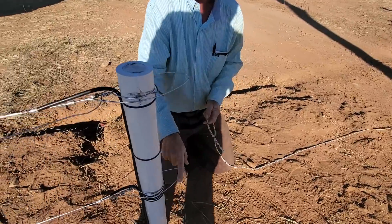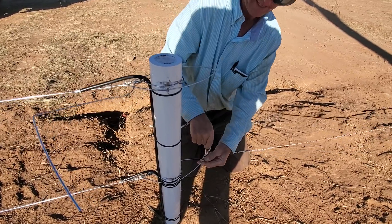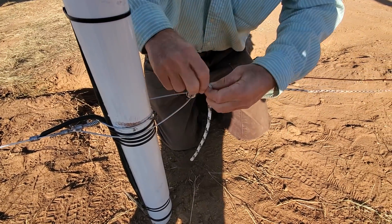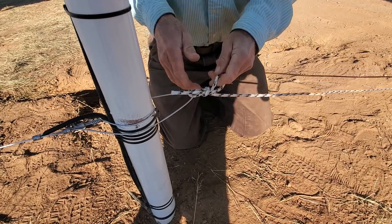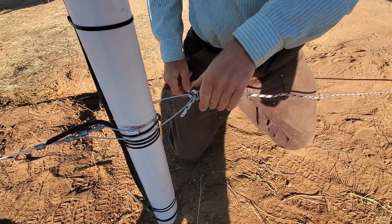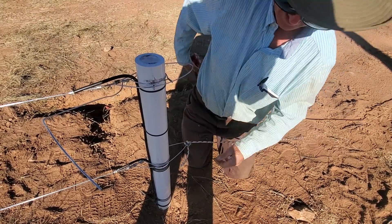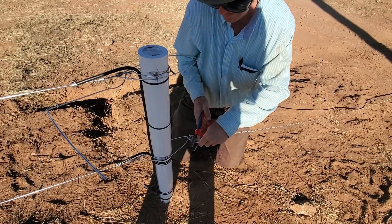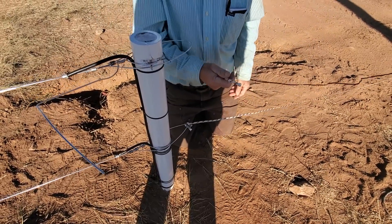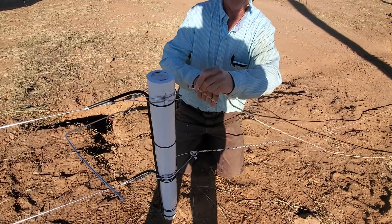This is our Turbo poly rope and we've already got our hooks on here. This hook is hooked into this high-tensile wire. I usually go around it twice so I've got two wraps, bring it around, tie my slip knot, get it tight, and pull it back. Then just take your side cutters and whack off the excess. Now I'm going to do the other one — come up here, go around it twice.